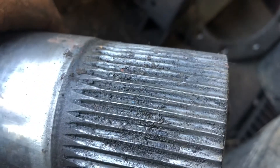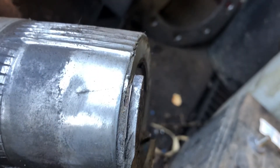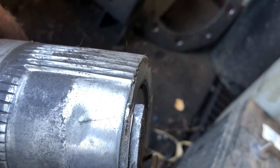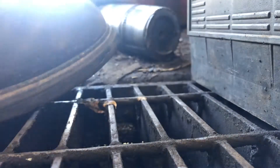You can see it was heavily worn. In fact, it was worn so bad that when we tried to take it past the snap ring that retains it, it was so knurled up we couldn't get it over it. We had to cut the base of that portion off here to get the yoke off to do the repair. Once you do that, things get quite a bit better.